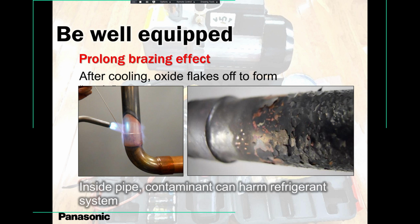But I'll tell you, I inspect these units when they come here and I find all these problems and I take pictures. Leak locks. Leak locks are not for our heat pumps. No matter which manufacturer you are listening to, leak locks are not advisable because all our heat pumps have screens inside, unlike refrigeration equipment. Refrigeration equipment is okay. They tell you, use it, no problem, because their systems don't have screens inside. Tiny screens, you know? So please, guys, don't use leak locks. Because you're not confident with your flaring? No. Never use leak lock. Period.